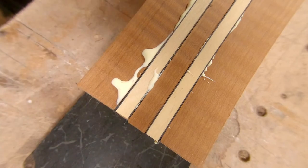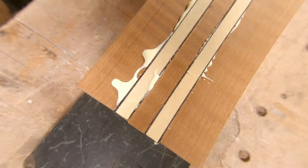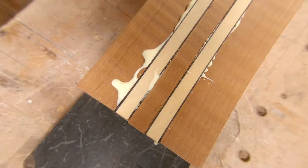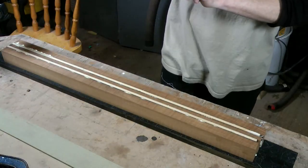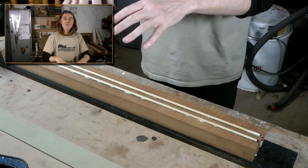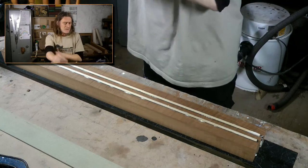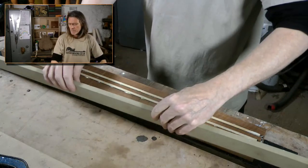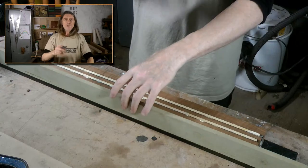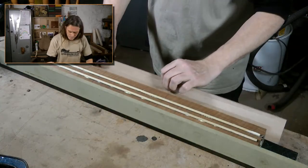Roughly. Okay, and someone was asking about how to stop it moving about while you've got the glue on. So of course everything behaves really well while it's dry. You get everything clamped up and you do your dry run. Did I mention that? I always dry clamp. So before you guys got here, I had a practice run, so I know I've got my clamps ready.